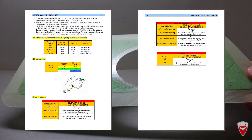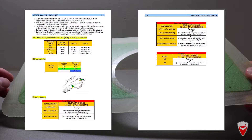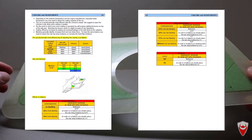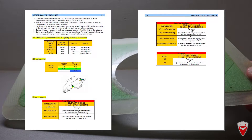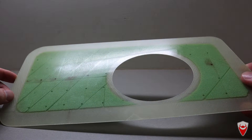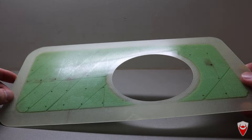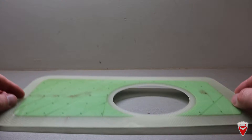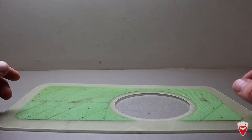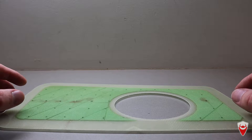Dallara provides helpful tables that tell you what to remove or add to get the cooling you need, and they also provide tables that tell you what you have to do with the wings to bring the car back into a neutral aerodynamic trim, because the exit airflow out of the radiators actually affects the downforce the car makes. This is actually the fourth time I've made one of these components for the same customer — the third time I've made an exhaust one and a second iteration of this exact one. Previous ones were for the other side with no exhaust, or for a previous exhaust pipe with a different exit position and shape.